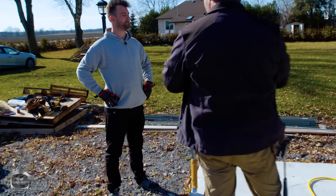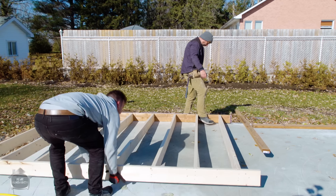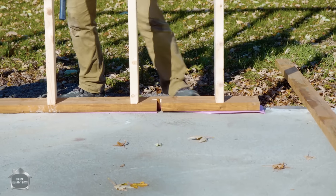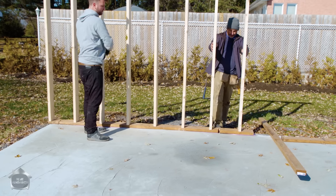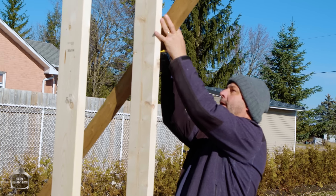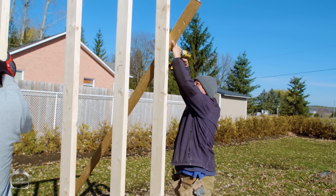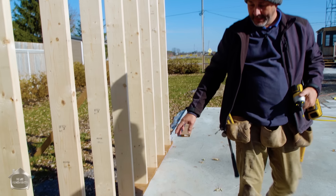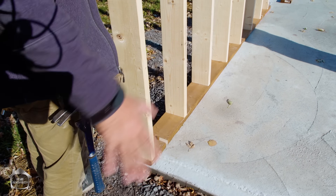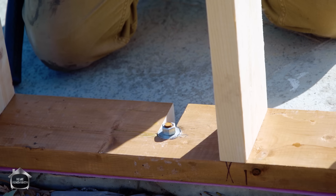We're going to put nuts and washers on those after we lift it up. Let's get it in position all the way up — bunny it up and back. It looks pretty good. I'm intentionally trying to hang off the edge of the concrete a bit so that all the water diversion is away from the building. We're just tightening down the washer until it's denting into the wood — that's going to keep that lumber from going anywhere.